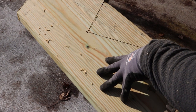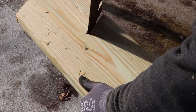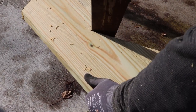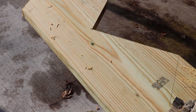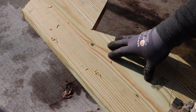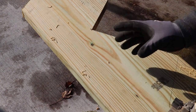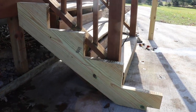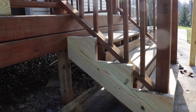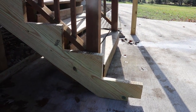I'm also going to have to notch this for a 2x4 and put a 2x4 all the way through the bottom. That will give me something to attach the stringers to keep them from wobbling, and also to attach it to the concrete if I want. You don't really want to overshoot those cuts to get it to go all the way through, so I just finished it up by hand. If you take your time and cut this first one as accurately as you can, then you can take this one and use it as a template for the rest, and then you'll have four of them all the same. You can see my new stringer compared to the old steps — that's going to be a little bit easier to manage set of stairs.